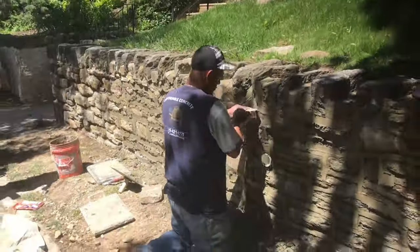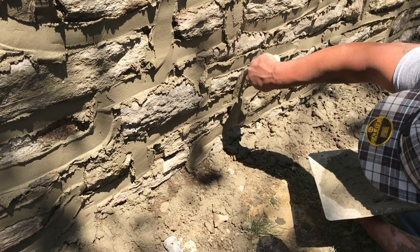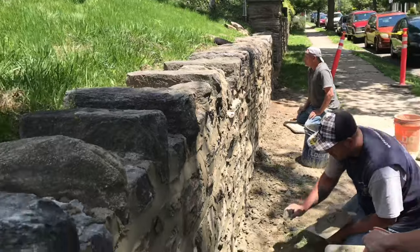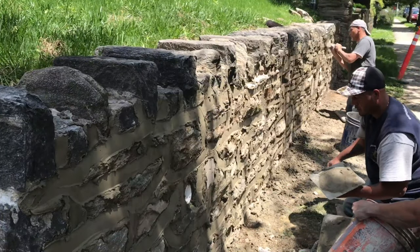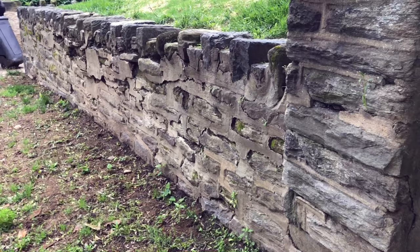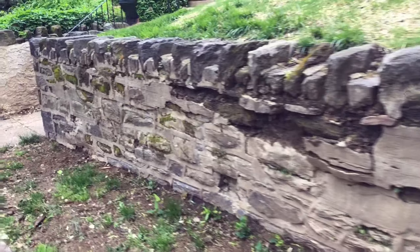When we point the wall, we restore the joints matching the original style. For our mix design, we use a 1-to-5 mix ratio, 1 part Portland cement to 5 parts brown sand. We use brown sand to achieve an aged, earthy tone as opposed to the white tone of new mortar. Brown toned mortar makes this job appear as if it was completed many years ago. In the description section of this video, I will list all of the tools and supplies used to complete this project.